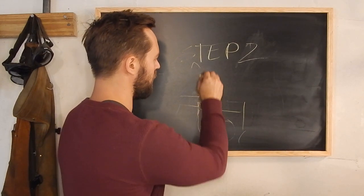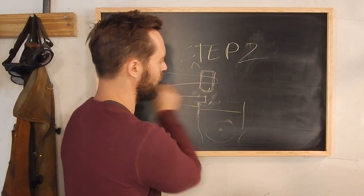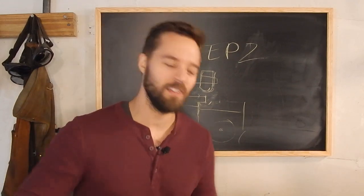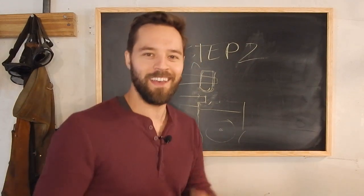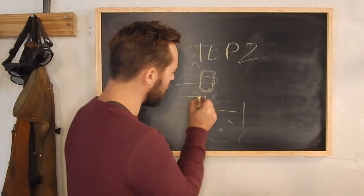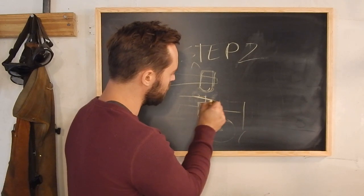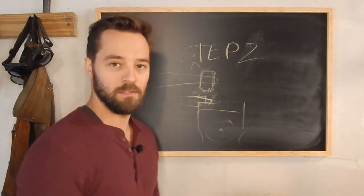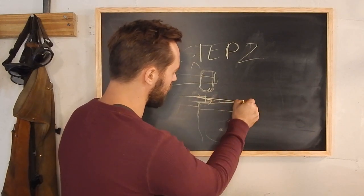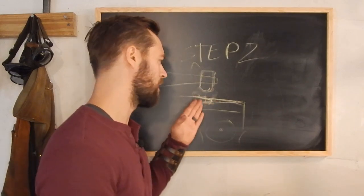They make these hammers that have a round side on one, flat side on the other. I love those hammers because it's just like having two hammers in one, you know? You flip it, and yeah, it's great. Okay, you get yourself one of those. So you hit right there, boom, and what that'll do is taper things down, right? That's great, that's what we want to do, but we want kind of a long taper. We want to bring it out to there. And this is a really big chunk of steel, so it's going to take a little bit of work.